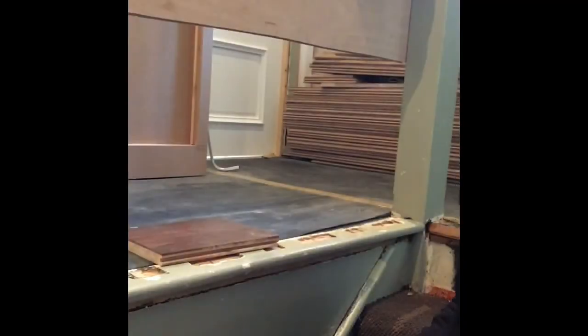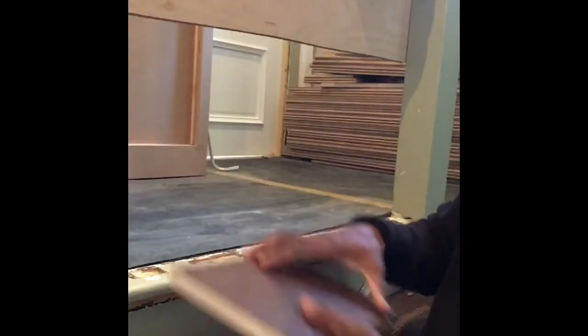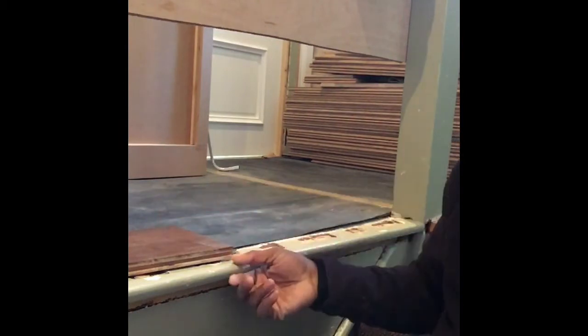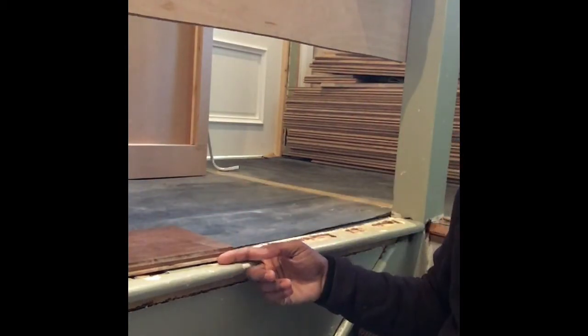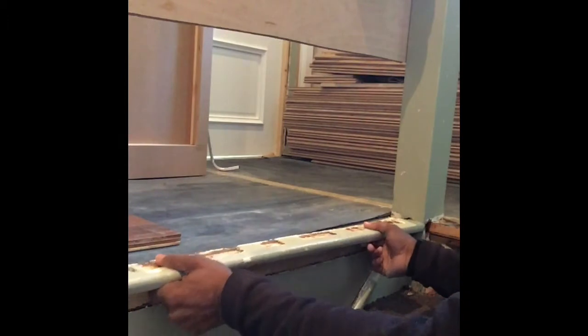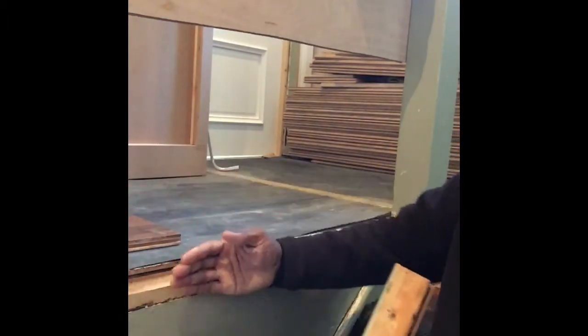I'm sitting here on the top step of the landing, of which I'm about to lay a new floor and finish my spindles. Now, what I don't like about these kind of jobs is when people put a new floor over the existing nosing, and they just put an edge here, which means you have a step and a step. I don't like to see that. So what I'm gonna do, remove the existing nosing, replace with a blank piece of timber, which will finish flush to the string.